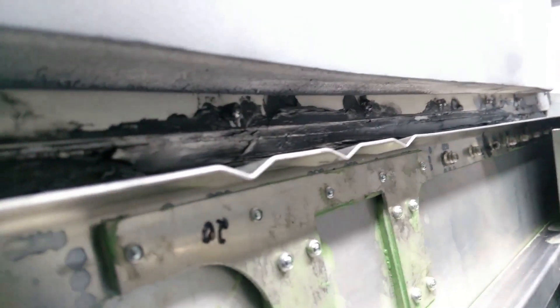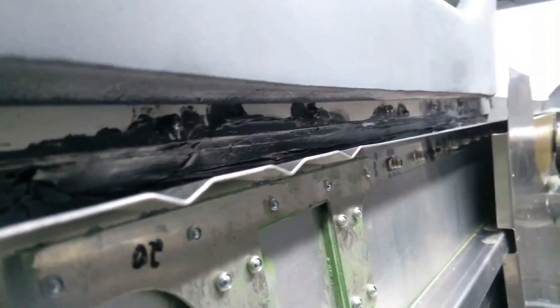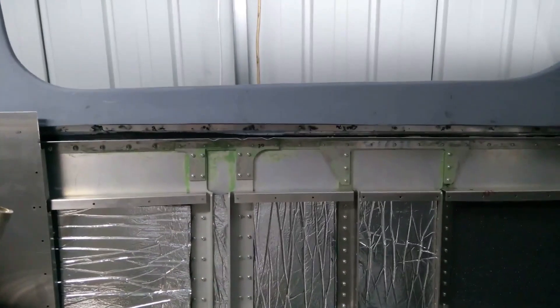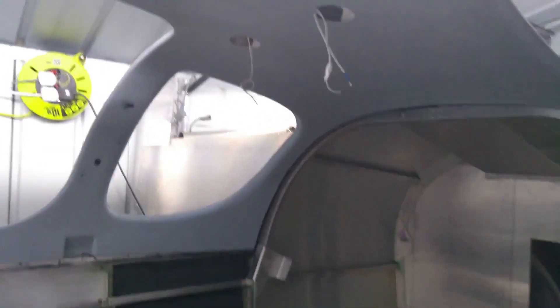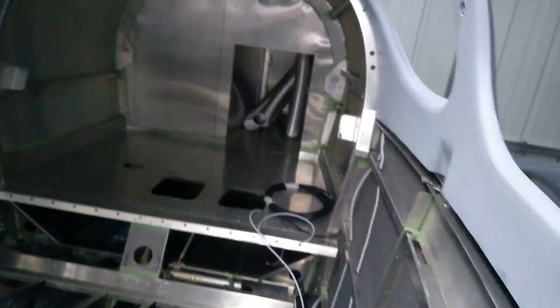If you zoom in you can see — I instead went with 12mm long rivets because the 8mm ones don't stick out much. There's also a retaining aluminum strip along the back which sits inside the fiberglass bit of the canopy. You can just about see it there — it perfectly aligns every hole, which was good. All the wires were put in before I did that, and they come out over here — separated into the two for the front lights and the rear cabin lights.